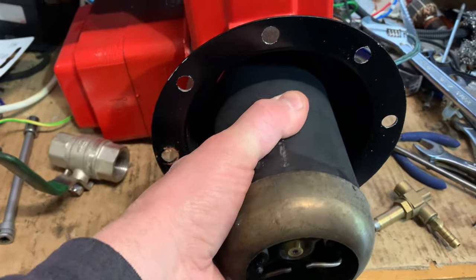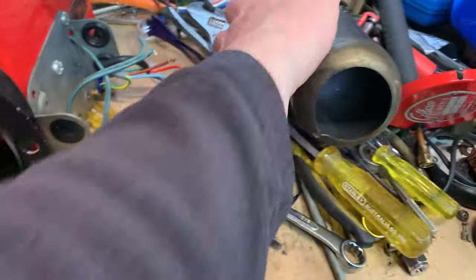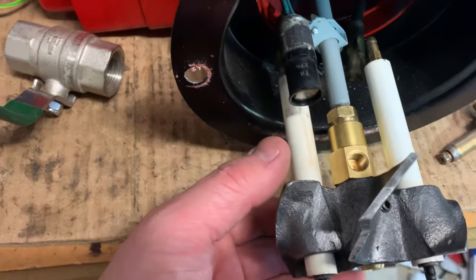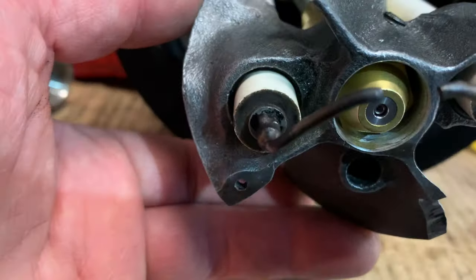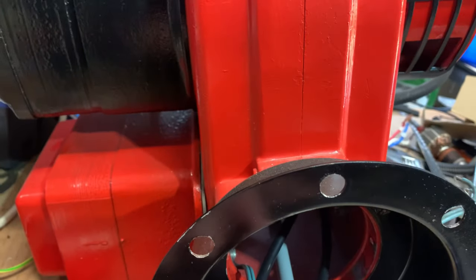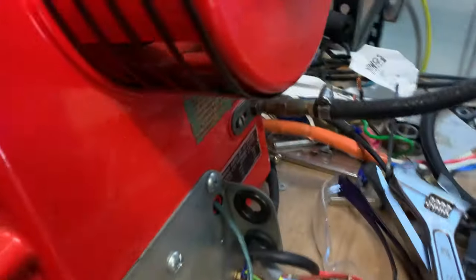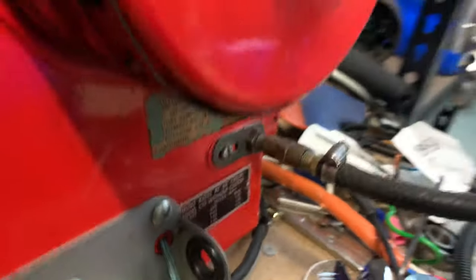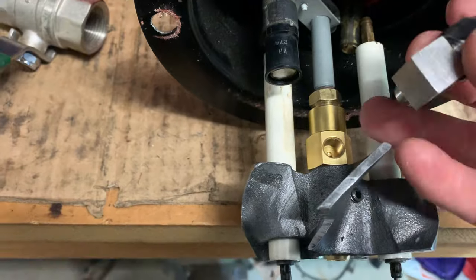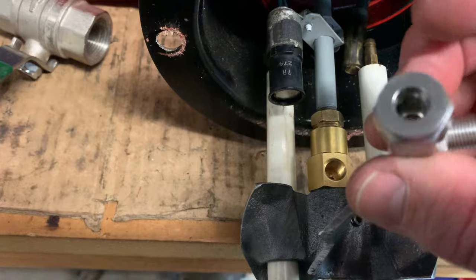This is the business end here. I'll just pull the snout out gently. What we've done is pulled the original nozzle out and inserted a siphon nozzle — it's got a 1.5 millimeter jet in it. The existing oil line for the burner will become our airline, starting just there, and then our fuel line will come in from the back.